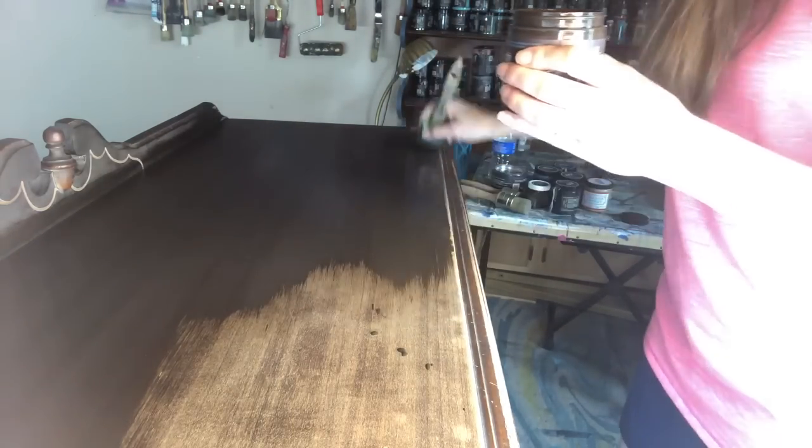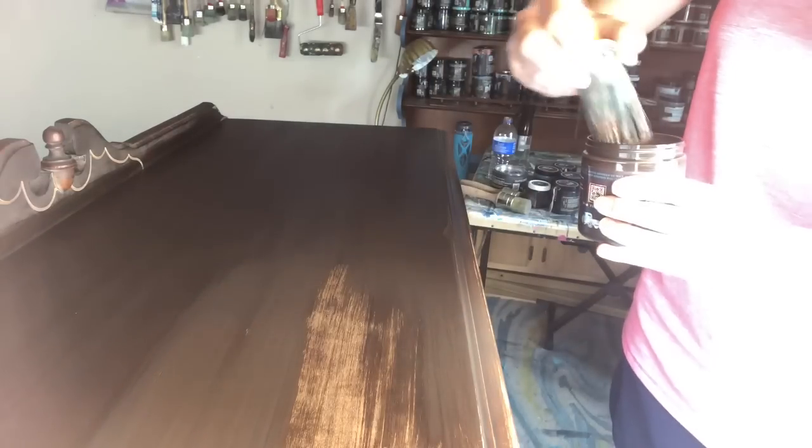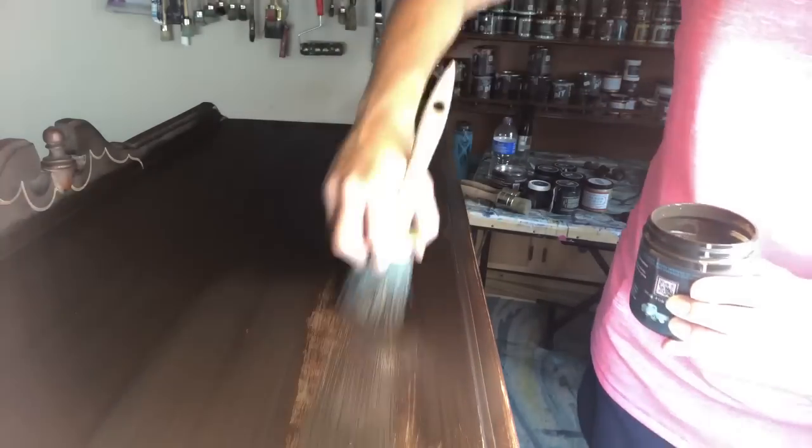I wipe it with a cloth to get it just the way that I want it. It's very simple, very easy. I will give you some close-up photos here in just a moment. As you can see, we are truly just about finished with this top coat. I'm not getting it too heavy, and I'm not going to go back over it once it's dry. Just straight, even strokes so it doesn't get too thick or too thin in one particular area. I'm only loading a little bit on my brush and working side to side with the grain of the wood.